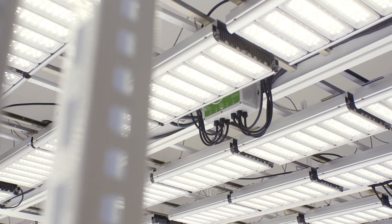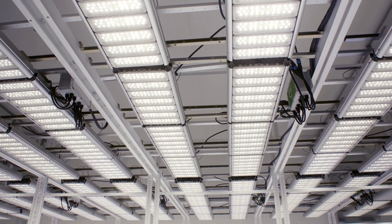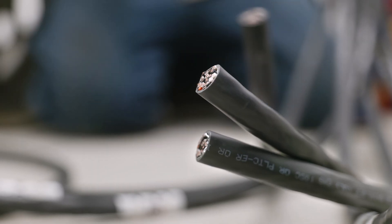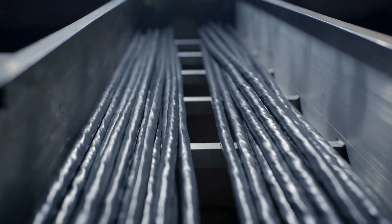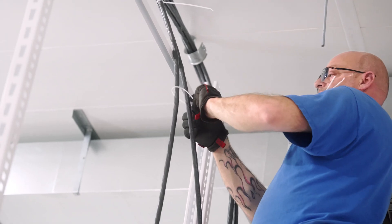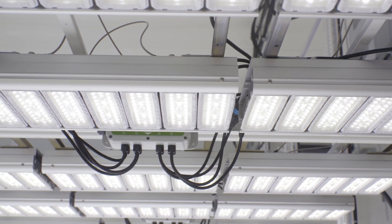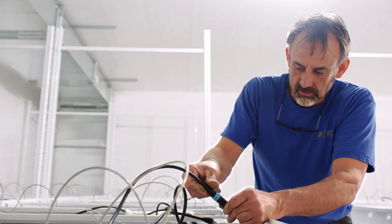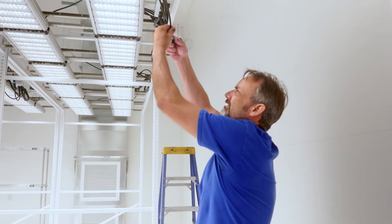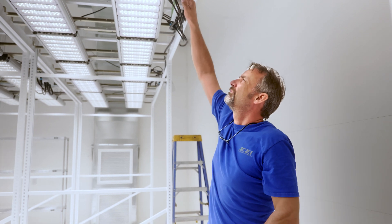In a typical install with a 480 volt system, we'd have over 150 amps feeding both rooms. These are digital cables output from our relays — they go out the top of the rack, up through the ceiling to a cable tray. Our Belden 8-pair cables come across onto a J-hook. Each cable that comes in picks up eight lights off of a rack. They're quick connect — you can plug them in or out whether in operation or not.